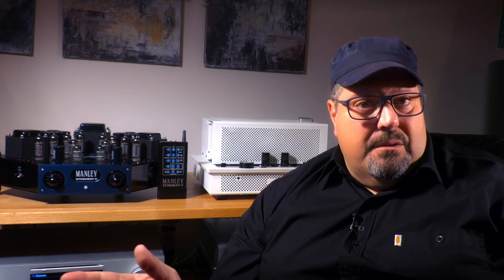Eager to listen to the i50 in comparison, I moved the cables and ran through the same playlist. The first impression was a clearer and more confident presentation with less subjective tube saturation, which made me wonder if the bias might be off on the brand new factory-sealed Stingray. Therefore I completed a full bias check, finding a couple of tubes being off by 20 to 30 millivolts. After that I carried out the same listening test again, but could only detect a very subtle difference in the subjective sound. Certain types of music sit more at ease with intense tube coloring, while other genres don't benefit the same way to my ears. After longer periods of listening, too much tube coloring leads to listening fatigue. I found the Stingray 2 to offer a beautiful and very deep soundstage, but it could not be quite matched by the i50. The Stingray also presents a bigger sounding bass — in my test setup I found it too fatty sounding, which was actually beneficial to some music.